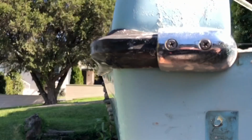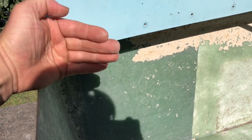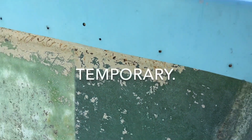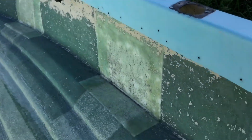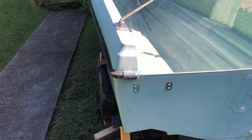So before I start laying resins on the inside, where the tabbing was, obviously as the back comes out, it's twisted and pulled back in. I'll be putting a timber from here across to the same point on the other side, under that gunnel, under the top deck, to push that back out before I lay up the glass. My rear seat will be sitting up against all that and hold it out. So by the time I'm finished, it'll all be dead straight again.